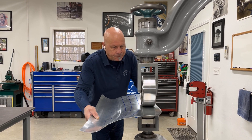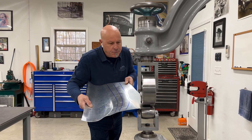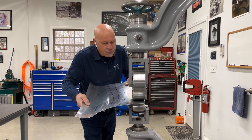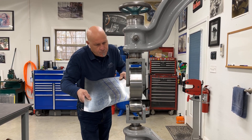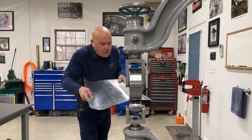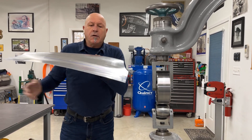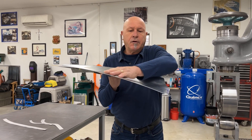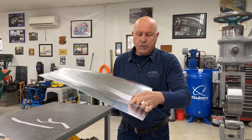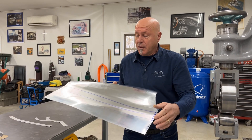Notice I'm stretching on the edge, working my way into the panel. Once I stretch that edge out, I can then stretch further into the panel. Just keep that nice and constant - it's causing pressure to come into this section here, and it's also giving it a nice little roll over. As you can see, it's starting to come over more and more, and all this coming over throws this end down more.